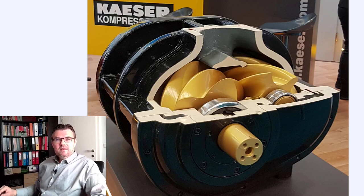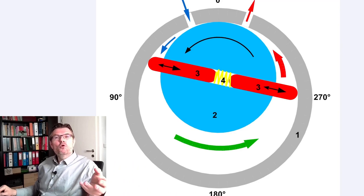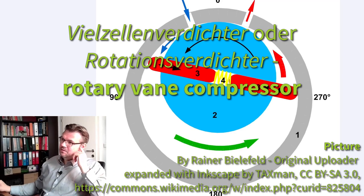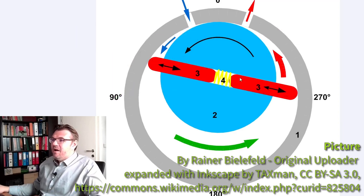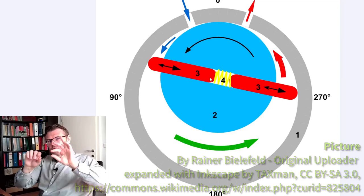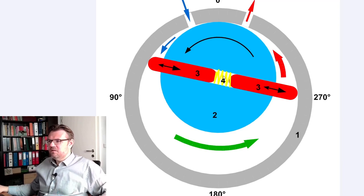One other possibility of shoveling air to the other side is something like this, the rotary vane compressor. So here is the intake, and those red bars are allowed to travel radially out and in. They are spring loaded, you see the spring, so they will always touch the casing. And there is an eccentric rotary element inside there. You see it will rotate in this direction, so we will suck in air here,